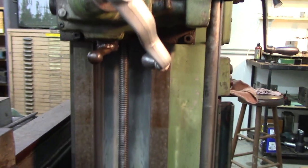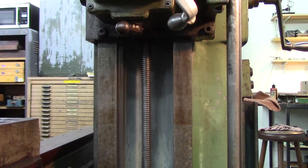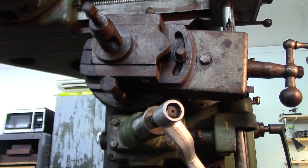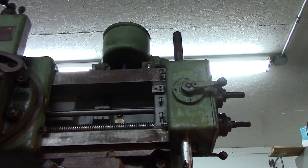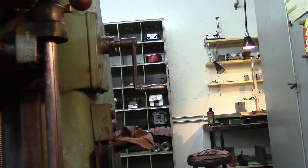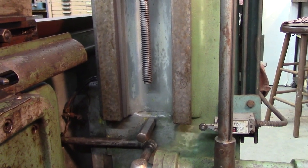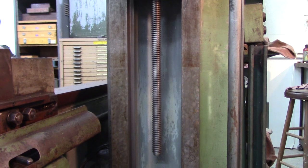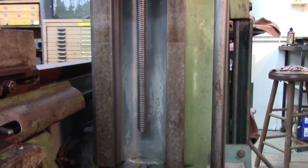I've been cleaning. I got the light on down here as well. So there's the cross rail, the side planing head, and it runs on the same ways and the same screw. The crank turns the acme nut to elevate and lower the cross head. The top round thing is a gearbox and it's actuated by the crank on the side. This took a lot to clean. I had a tin can full of lacquer thinner and I just kept washing that lead screw with lacquer thinner and a brush, and the same with the ways. So that's all clean.